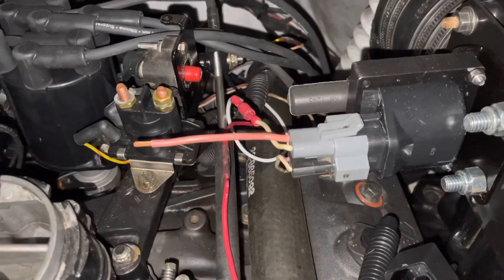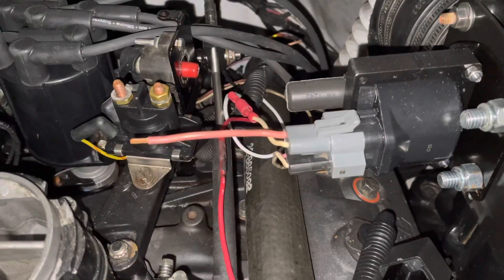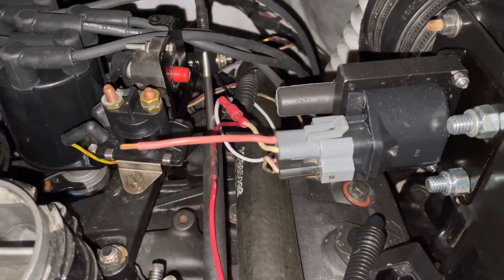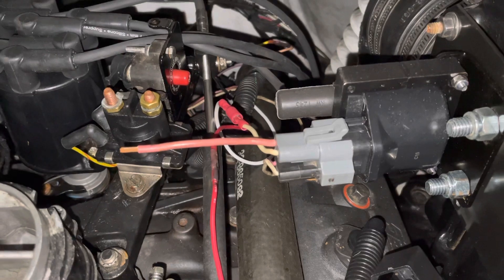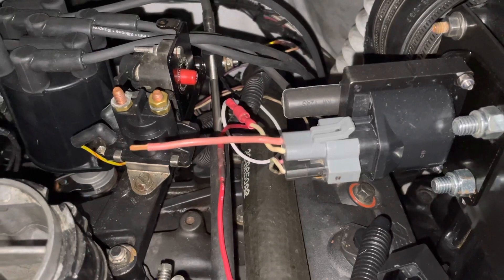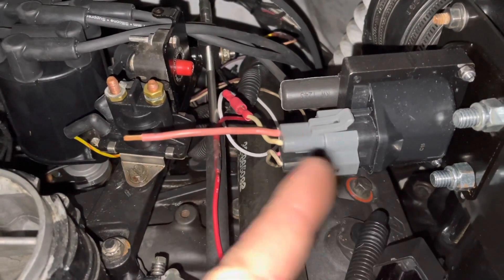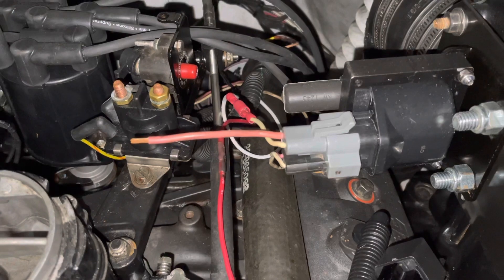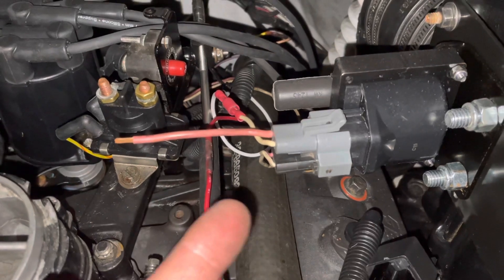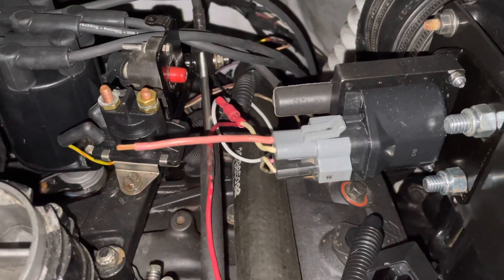If you look at the wire diagram on a boat like this, there's a purple wire that comes from the ignition switch, and that purple wire feeds the fuel pump, the ignition coil, the Thunderbolt module, and also goes to the back of the alternator. That purple wire looks to me like an 18 gauge wire, and with the fuel pump alone I would think that would be a little bit small. Then you want to put the module and the coil on the same wire — I just don't see that being a wise thing to do. And if you remember Part 4, that's what I did. I wired the purple wire to power this coil. The engine ran, but the more I thought about it, the more I wanted to do this right.